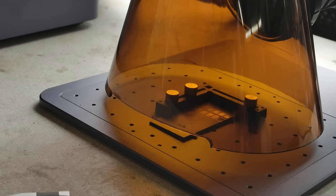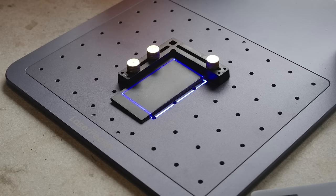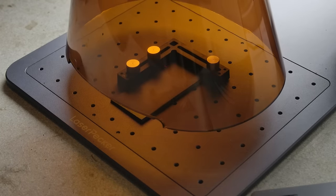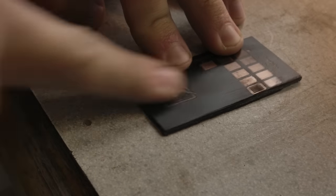The laser pecker interested me for its incredibly high resolution compared to the laser that I already had. It also has two different types of laser, allowing it to engrave almost anything, but that's something I want to use more in a future video. Using a painted offcut, I set up a power test in the software, and after a few tests at different resolutions, determined the power and scale I would need for my board.